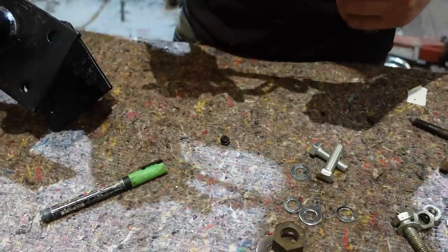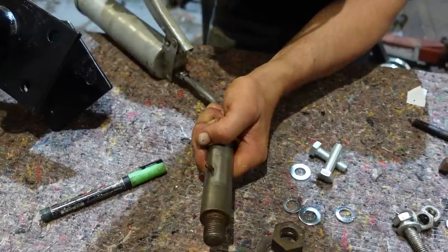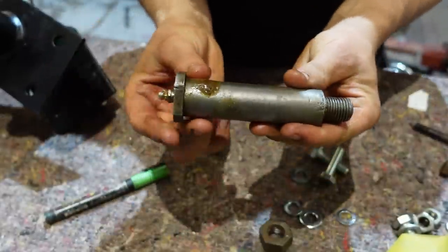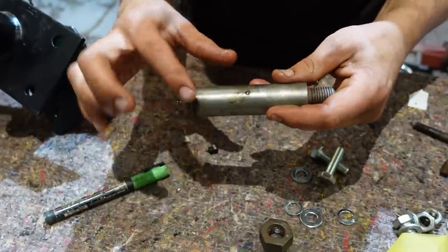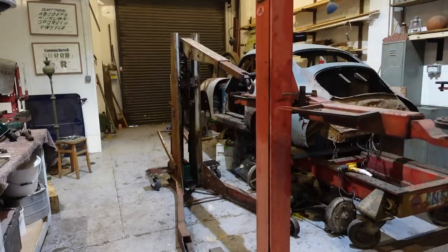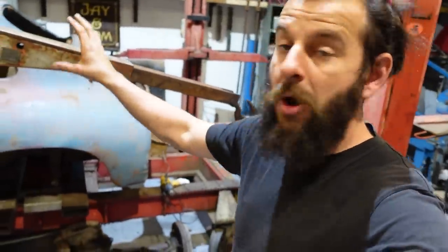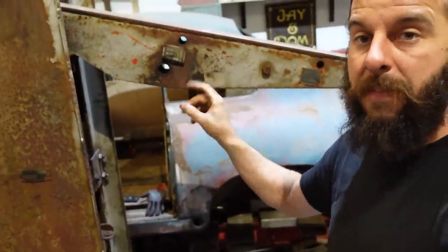This is a new little grease nipple for this pivot. Once that is installed, it's still accessible from the outside and allows grease to go in with the special tool - it's hollow with a little hole through the middle and a little hole there so I can grease this pivot point from the outside. Someone actually suggested this in the comments, so if that was you, brilliant - you've planted the seed in my head. I've used the lift to hold the end of the boom part of the crane so it's stable and in position and not going to fall down and chop my arm off, so I can manhandle the piston in and try to get the pin through that hole.